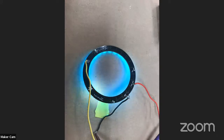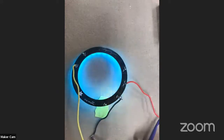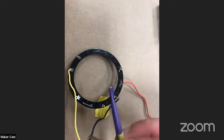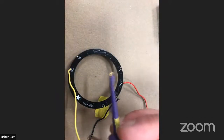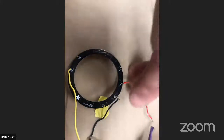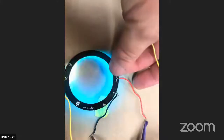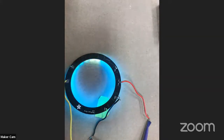How quick and how dirty can you get? You want to move quickly. Don't assume that you need to solder. These are called mini grabbers — made by Pomona, about $5 each — and they make your job easy, but they're an extra connection. What Patrick was working with is just disconnecting everything and working directly with the wire.